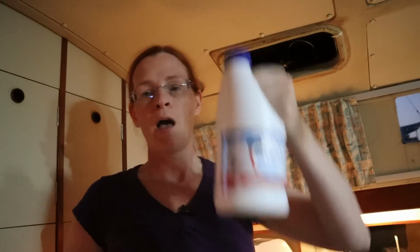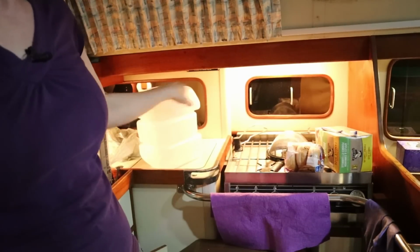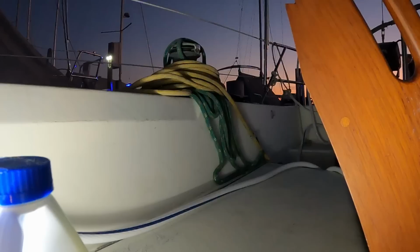Where's the bleach I got? The bottle of bleach that I got is 1.27 liters, so we're going to round this, it doesn't have to be a super exact science. I'm going to use 2/3 of this bottle mixed into the old water jug. I got a new water jug, so I'm going to use the old one to mix 2/3 of this bottle into that with water, and then I'm going to pour it roughly a light 1/3, a light 1/3, and the balance into the V-berth tank, and then I will fill up the rest of the tanks with water, and then I'm going to start a 1-hour timer. And I'm going to link below the guide that I'm following.